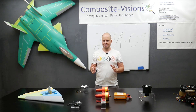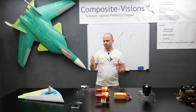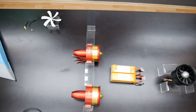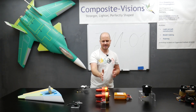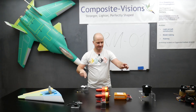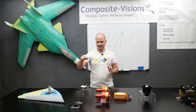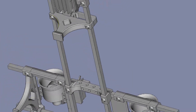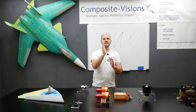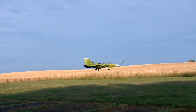As you saw, here was also a second decision made: the leveling concept. There are a lot of solutions for where you can put your leveling fans. I decided on the three-copter design. The CG will be here, and the main engines will be mounted at the CG so there is no momentum from them — just lift upwards. These three fans all around will level the whole thing as a three-copter. We have three motors, and under the front motor there will be movable vanes which can direct the air left and right to generate yaw momentum.